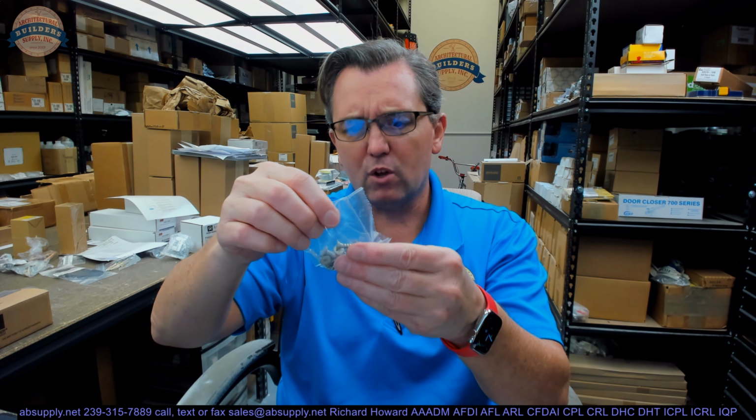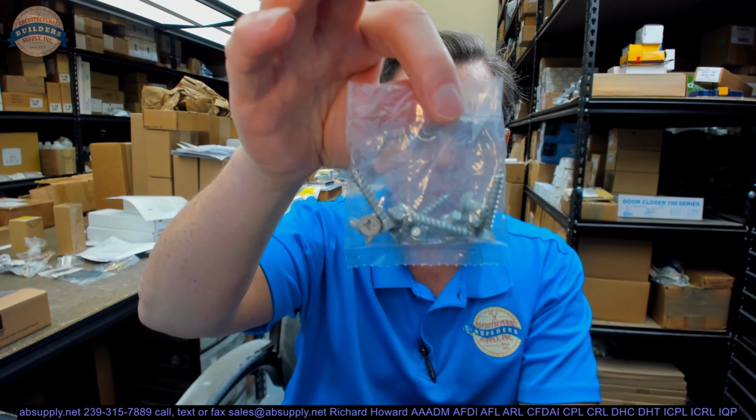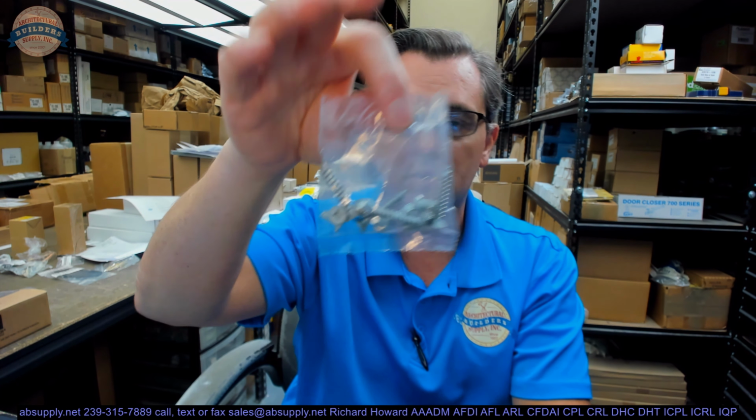This is a point that requires clarification. In this package, there are 4 wood screws and 8 metal screws. That's definitely a really good guess. I don't know what this client is using. They didn't qualify at the time of order. This is clearly the standard packaging from the factory, because that's what this came with. In all instances, it would be considered best practice to indicate what screws you need. This client might have a wood door and a wood frame. It's very possible. And in that case, he's got half of the screws that he needs.